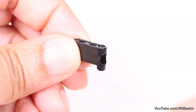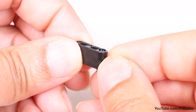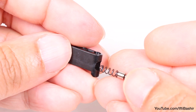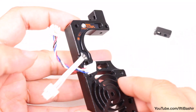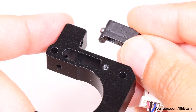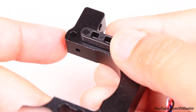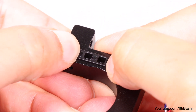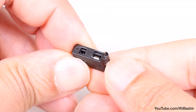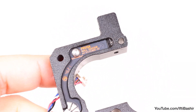Next, we need to construct the Prusa ball holder by holding the plastic part and inserting a spring, followed by a magnet, and finally a steel ball in that precise orientation — so in essence the order looks as shown here. Once ready, insert into the heatsink on the opposite side to the sensor board we previously installed. Notice the protrusion on one side: this faces downwards, with the ball being closer to the edge of the heatsink. When looking down from the top you should see the ball protruding through part of the hole. As the filament is pushed through, the ball is pushed to the side and the magnet triggers the sensor, letting the printer know filament is inserted.